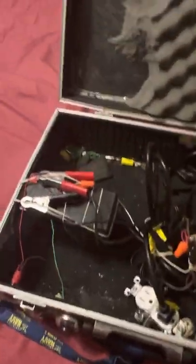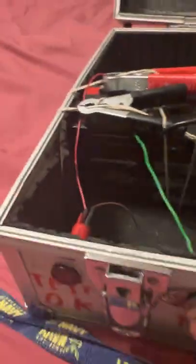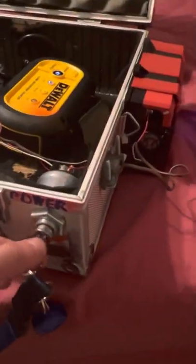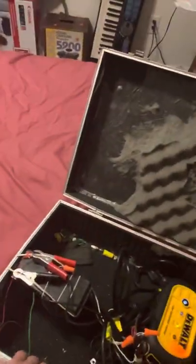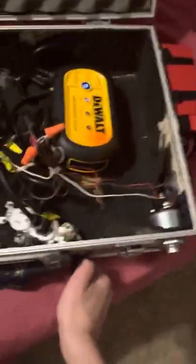When I could just plug whatever I need to charge or power in here because it's getting power from the wall. The battery is a sealed lead acid battery — it's a 12 volt 8 amp hour. I plan on getting another one because this is an ignition switch; it has a start position which is momentary but it's got a second position, so I plan on wiring another cable and buying another higher capacity battery on the second pole. I also plan on applying Dean's connectors and attaching a solar panel.